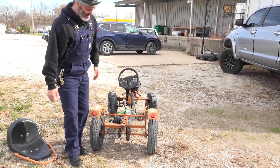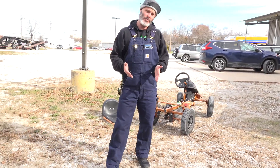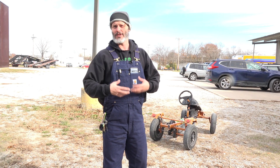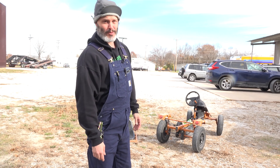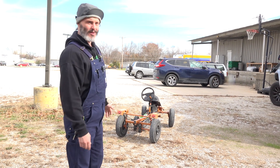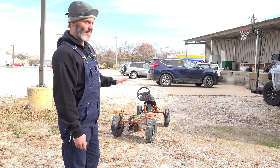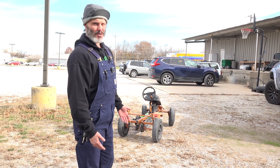Essentially I took a piece of angle iron. When we slammed the axles back together, we had the axle chamfered so we could lay a nice bead down on the inside and then lay another bead on top — that way it'd have a little more welding adhesion. It's a terrible welding job; I'm not a professional. I probably haven't laid a bead for a year or more, but it'll hold. And if it doesn't, we'll just re-weld it — I'll get out my TIG if I have to. It was just a 120-volt MIG, nothing special. Really didn't have enough heat, but I'm not worried about it. This was kind of a hack job and it was a lot of fun.